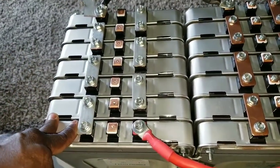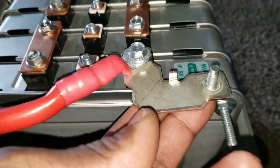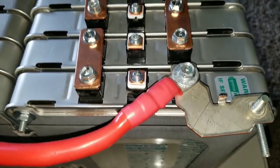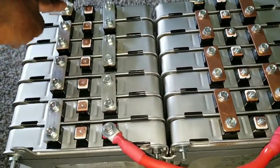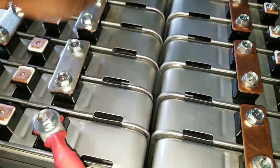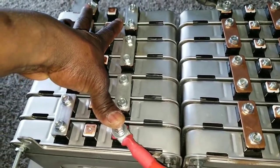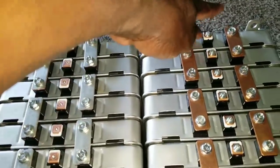All these cells are wired in series to 48 volts — this is a 14S configuration. I added the bus bars that Nissan had on their batteries. I'm going to incorporate the charging connections on this side, drawing from each end. So here you have negative, positive, negative, positive all the way through, and you pull from the far corners at diagonal angles. After being wired in series, you then parallel the two packs together.